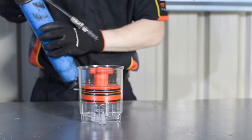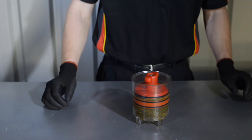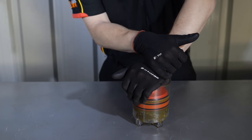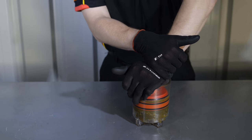If you're using a grease gun, leave the centre in place and fill the container via the grease nipple. Once the grease begins to come through the bottom where the bearing lies, you're ready to pack the bearing. With the grease gun removed, press down on the centre handle to force new grease through the bearing.